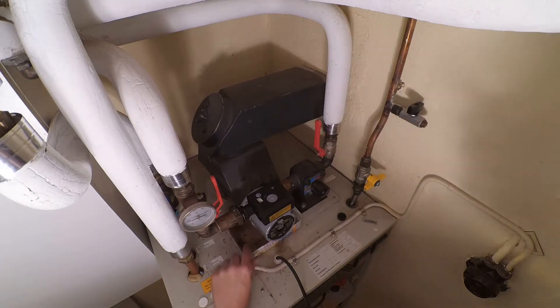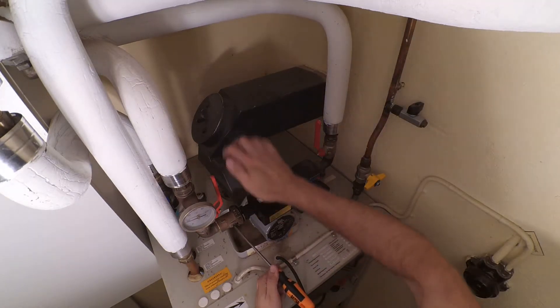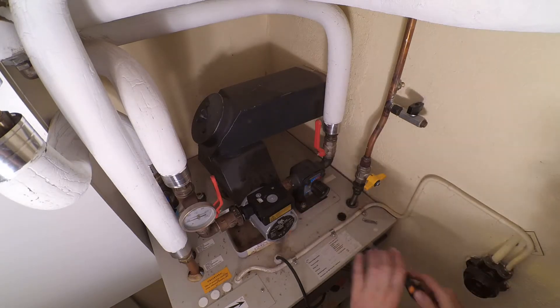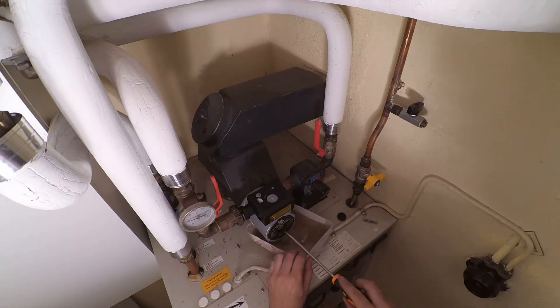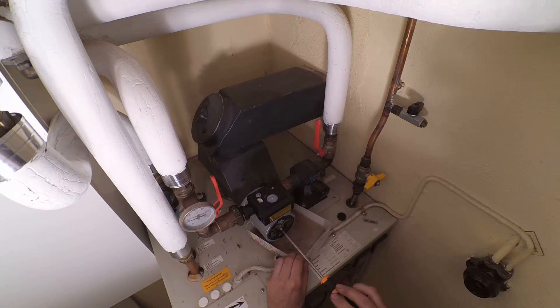Let's see if I've done anything right or wrong. Slowly open the valve — get the flutter out of the pump and let the slight backflow happen. Now this is a low-pressure system — it's only the house heating system — so there won't be any major leaks. Now we need to flush the pump: remove the vent screw. Normally you have to do it with the pump running too, but because this is a wet pump you always want water in it — never run it dry, or the motor will be destroyed.